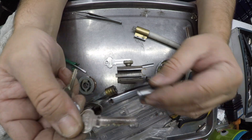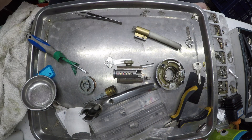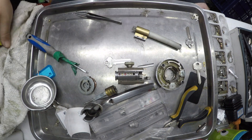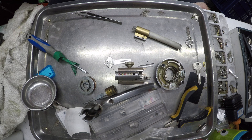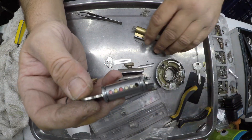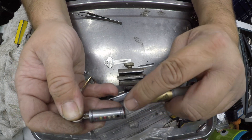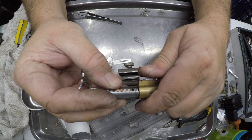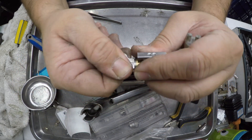I don't want to go down, so the quickest way is just to hit it with a file — take it down one cut, just enough. I've just hit that with the impressioning file — that's why some of them are a little bit wavy. That'll bring them down exactly. Sometimes you can get away with being a little high, but this particular lock won't let us. Okay, that looks a lot better. Going back in — I'll use a piece of shim again just to increase my chances of success. We're good — though those pins are still a little bit tight.